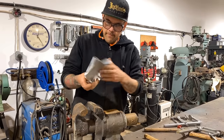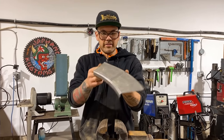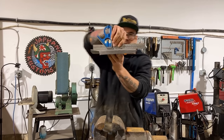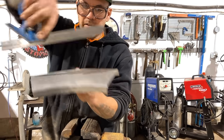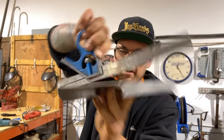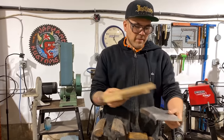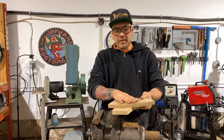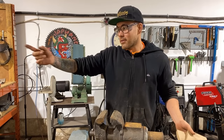Clamp piece off — look at that fit! We've got curved flanges on both sides, inside and outside radiuses. It stayed nice and flat because of our hammer form. There's a little bit tipped up on the edges since it's not held past that point, but look at that — dead flat there, dead flat there. That's the beauty of hammer forming. It's relatively easy to cut MDF and make yourself a clamp for a piece like this. The extra step with the bead roller, by comparison, is shrinking that edge.